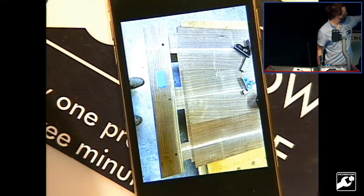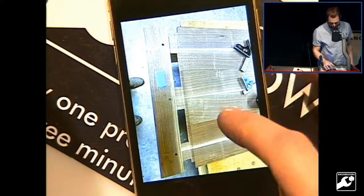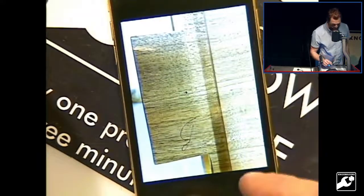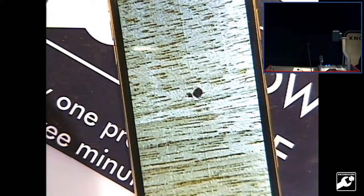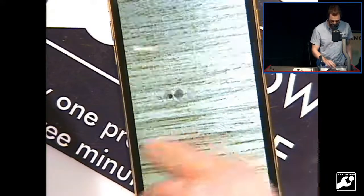So what I'm showing here is what's called a draw bore. This is kind of cool. You start by drilling your clearance for your dowels through just your breadboard end. Then you go back and reattach it. You can see here, there's no hole drilled through those tenons right now. Then you mark them, and this right here is the center of the hole, and that's where I'm actually going to drill it. So it's a little bit off center. What you get is when you drive the dowel through, it actually tightens that joint back up, so it'll never come loose on you in the future.